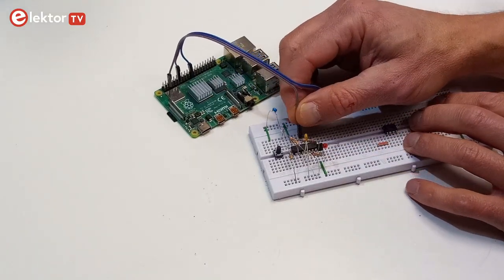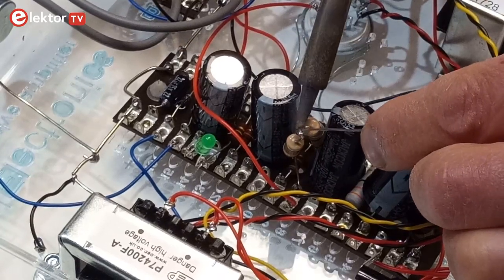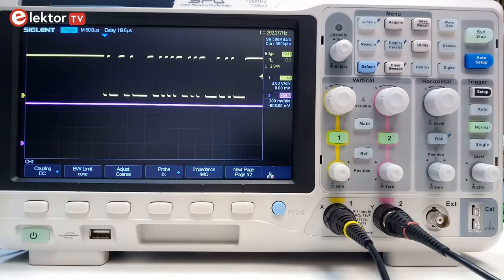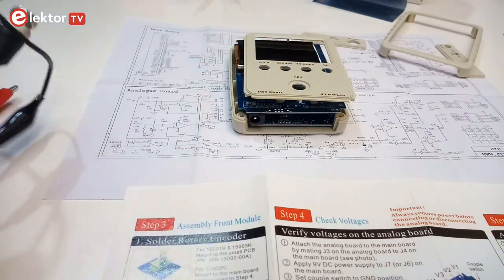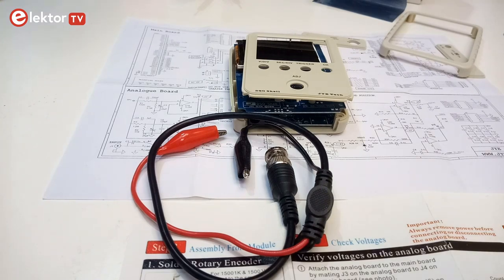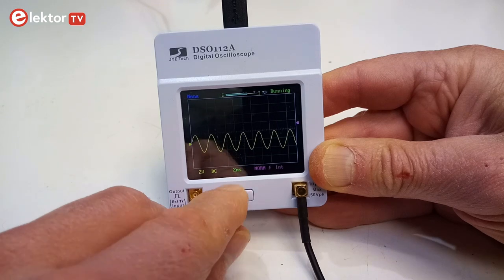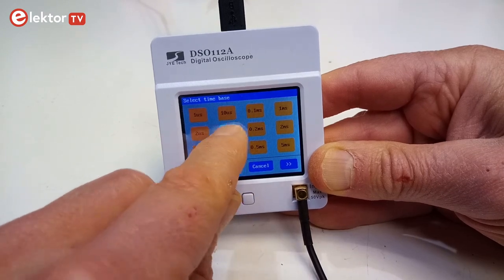If your thing is Arduino or Raspberry Pi based projects, or building and repairing audio amplifiers, or musical instruments, or guitar effects, there really is no need to invest in a 4 or more channel oscilloscope with hundreds of megahertz of bandwidth and many giga samples. A 2 channel 20 to 50 megahertz oscilloscope is just fine. However, even though it may seem tempting, I don't recommend spending money on those cheap, small DIY oscilloscope kits you can find online. They just do not offer the comfort and features of a low-cost but real bench oscilloscope. They may be practical when traveling or when you are really tight on space, but that's probably all they are good for.